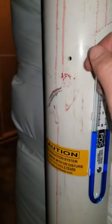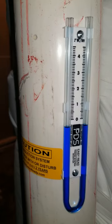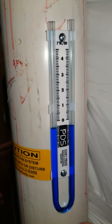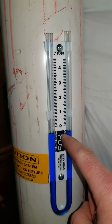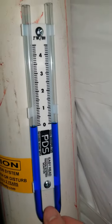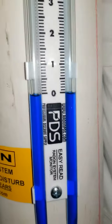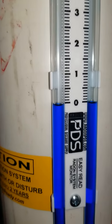I've drilled my 3/16 inch hole. I've not connected anything yet because this is a hugely common problem when these come shipped. See how these two lines are level but they're not at zero. You need to slide this tube up until both of these are at zero before you plug anything in, or else you will not get an accurate reading.